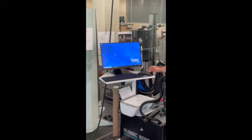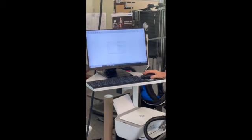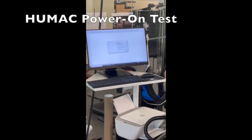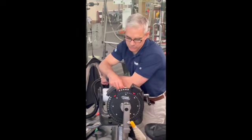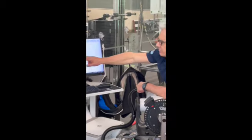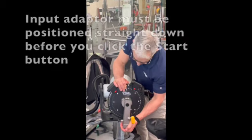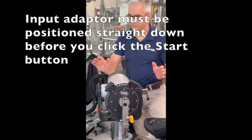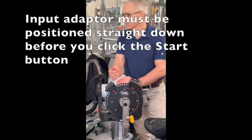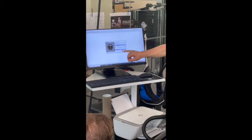The name of the program is HUMAC — Human Assessment Computer. Right-click and open the file to start the program. When you start the program, this is the input arm with no attachments — that's how you want to start it, because there are strain gauges here and you want to zero them so they don't see any force. Position the input adapter straight up and down, with the red tick aligned. When nobody is touching it, press Start. When the OK button goes green, touch it and the machine is live and ready to use.